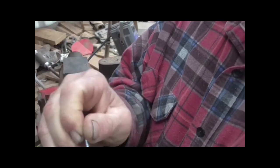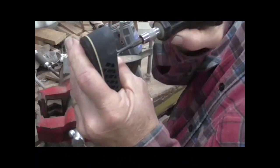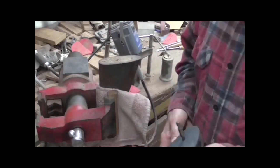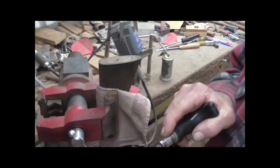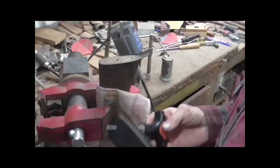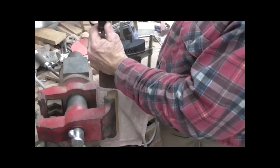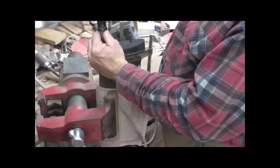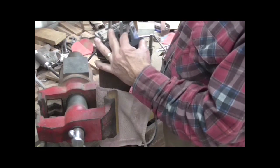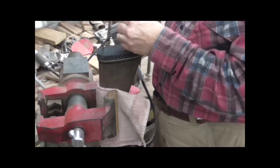You push it in there. When you shove that screw in there and get oil on it, you just push it right on in with your screwdriver tip. And I just leave the tip of the screwdriver stuck in there. I keep 2 of them at least. Just push it through. Just shove the head of the screw through there. And since these centers are the same as these centers, you just screw it right in there. If you don't have that luxury, you got to drill holes, which is very doable. By leaving those tips in there, you keep from having to pull it in and out, pull it in and out, and tearing that rubber up.